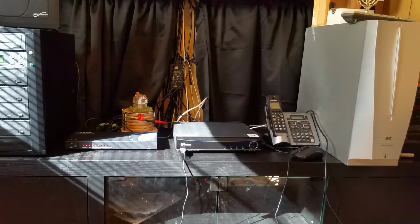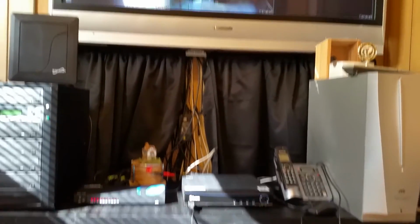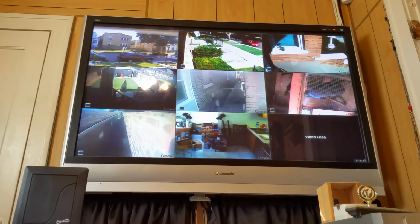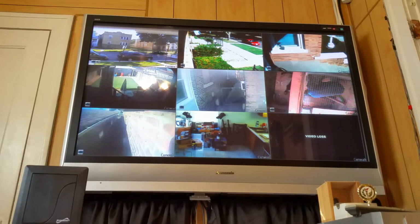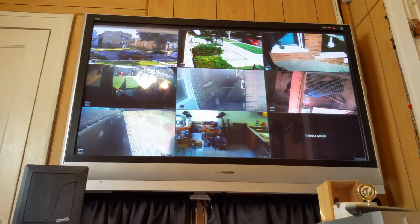Another thing I wanted to tell you is for the camera. Let me let you know that for the SWANN camera, it has to be hooked up to camera 1. That first one where I had it. That's not where my cameras were set up, in a different order, but it would not work when I put it on any other one of those cameras. The controls wouldn't work, the zoom and all wouldn't work. I had to put it on camera 1.